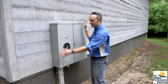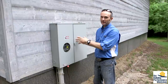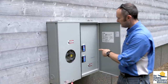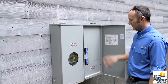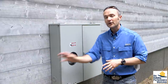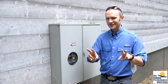It was basically this entire size just for two current transformers, because we're ready for 400 amps of service to come in here. We were able to downgrade — this is a 300-amp cabinet actually. We've got right here 150-amp and 150-amp fuses that we have access to. So we've got the ability down the road, if we ever needed it, for 400 amps. And what that means is you're going to run 400 amps of stuff at the same time — that's called your design load.